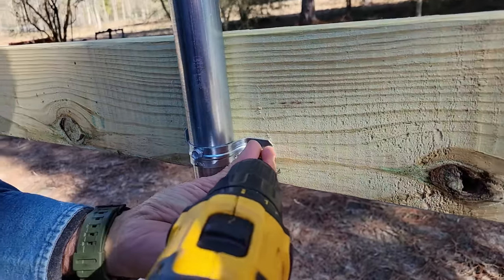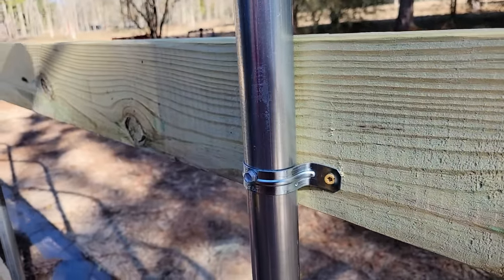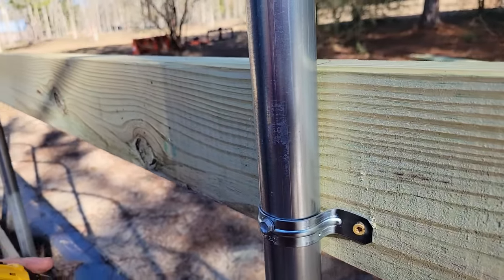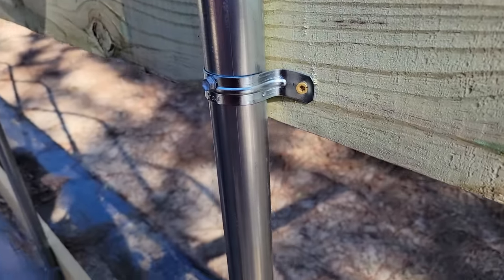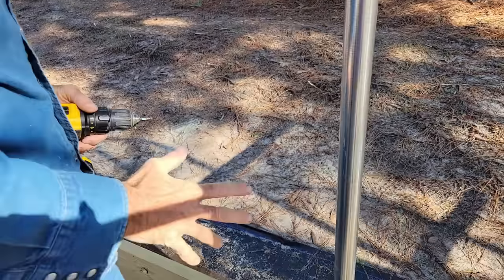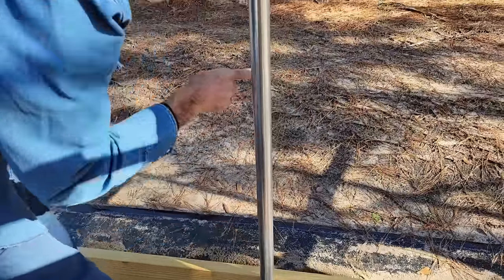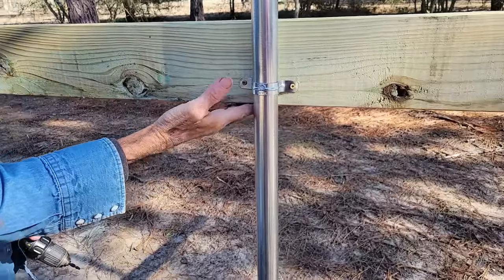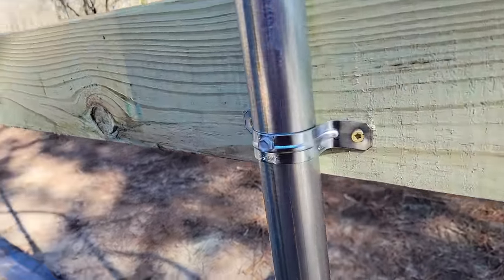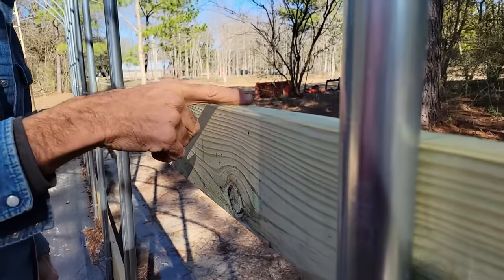And what I've done here, to kind of catch you up a little bit, is we're going to be putting 3 foot by 1/8 inch hardware cloth in here to keep the insects out, like we did over at Deepsouth. So I have 3 foot from the top of this board marked up with a magic marker on the other side of this pipe, which is the bottom of this board. And then I start on the other end and I have exactly 16 feet marked.